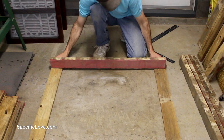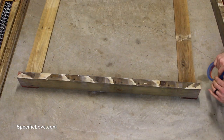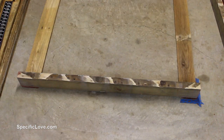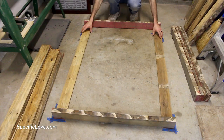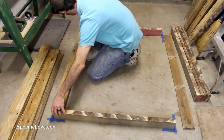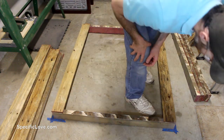To make this process move a little quicker, I set up the squareness of the first set of wood and then using some tape, I created an outline of the first set. This allowed me to quickly place down the next two sets for quick assembly. This is a great process to use if you need pieces that don't have to have exact measurements. For each of these, I used some glue and screws for strength. Once each set was secure, it was time to attach them together.